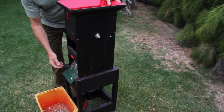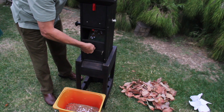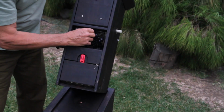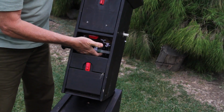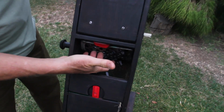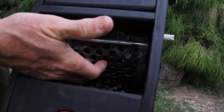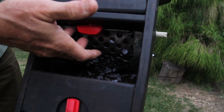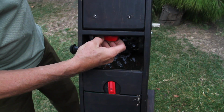Also, the exit chute here closes up for shipping. And the final bit I'll show you is this one right here, which is the screen, which comes down for cleanup. That comes from an oil drum lid. The holes are roughly about 1/2 inch in diameter, fairly close spacing. Hold it still up again, please. Okay. And down, and we lock it this way.